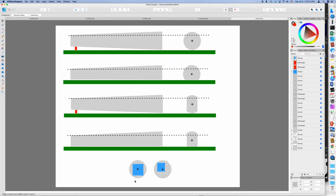Here we are with the toe board. Here we are without the toe board. And you can just see how much better of a cut you get when using that toe board to level your log, level the grain, level the center of the rings to be parallel with your sawmill bed.